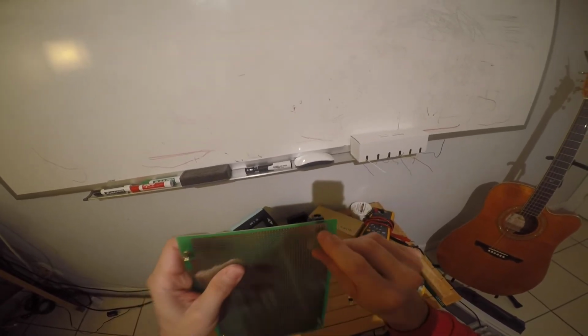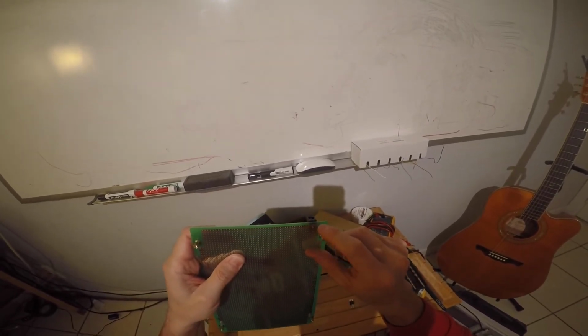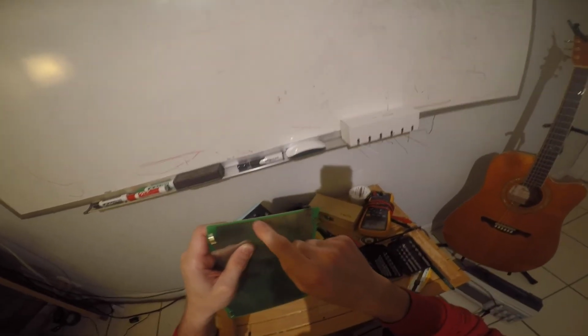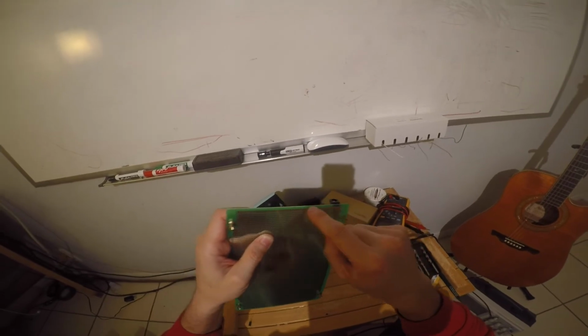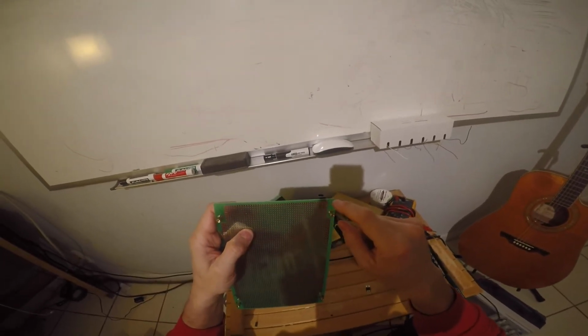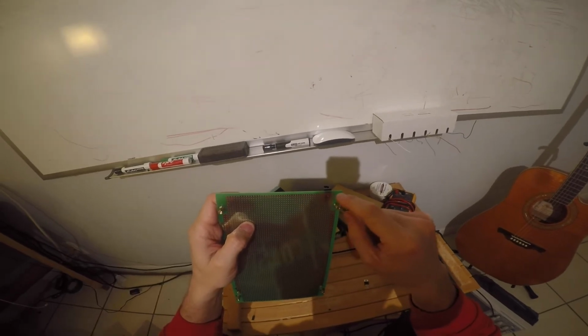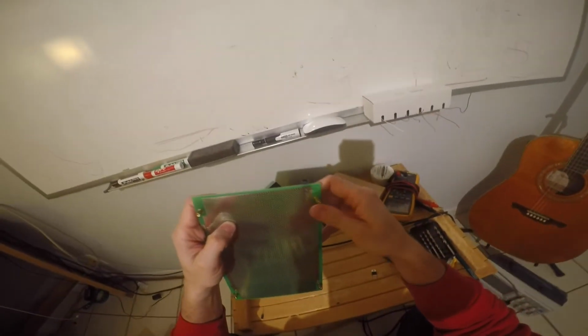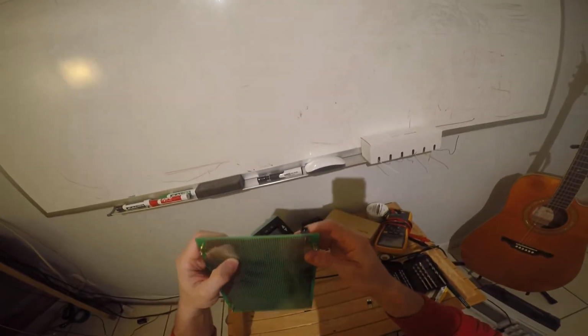What you'll notice is I was careful to make sure that I did not attach these pins to the, I don't want to put any of my pins through the holes that go on this bus. Whenever I put a chip on this board, I want to make sure that I stay away from these buses, because you don't want to connect all your pins together. Unless you intend to do that, right?